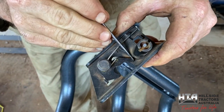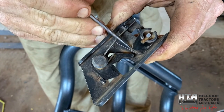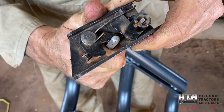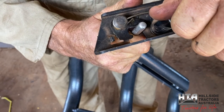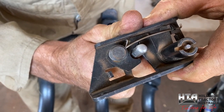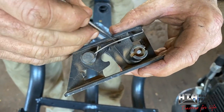To overcome that, we cut the corner off there — you can see a little scratch across there. So when this striker comes up, instead of striking here it strikes further up and has some leverage to push it back more easily. Once you get to the point where it latches, the ground-out section makes no difference and it will still drop in and latch correctly.